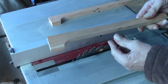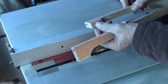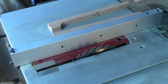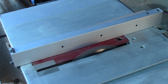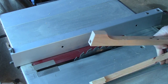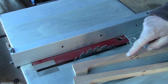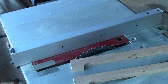Both ends are cross-cut. Now I want to get these level here — these two ends flat with each other — so I'm going to send it through just a little bit to get them level. Got these ready to go. Our next step is to start shaping. We're going to shape these on the sander to get them nice and smooth with each other.